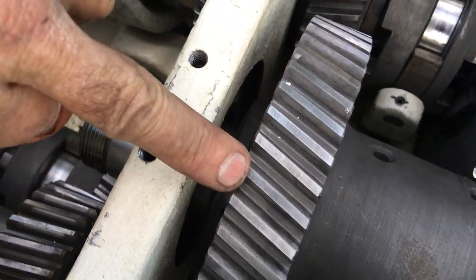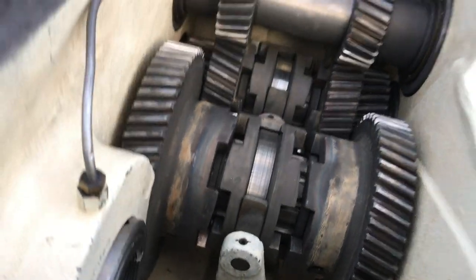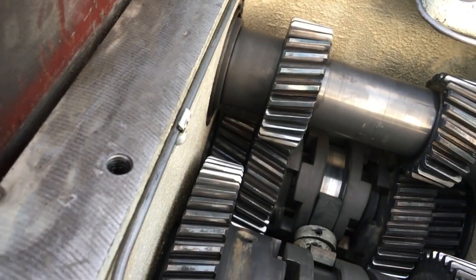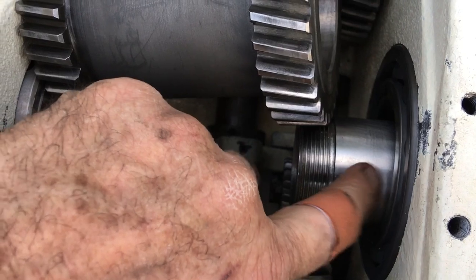Got the shaft started going through — got it through the gear. There's a thrust washer inside the bore, then through this blind collar, through this gear, then down between the bearing. There is another spacer that's also a thrust washer that goes between the bearing and this gear. Now we slide this collar all the way in, drop this one in, and bring the shaft back just a little bit. As soon as I have access to the keyway, I need to start putting the Woodruff keys in.